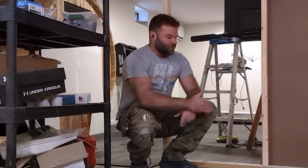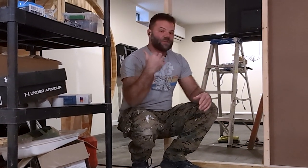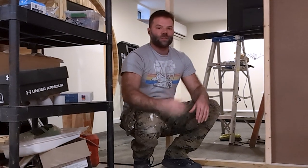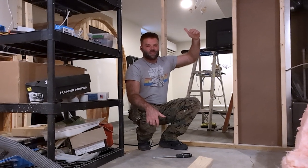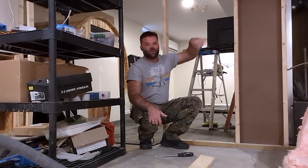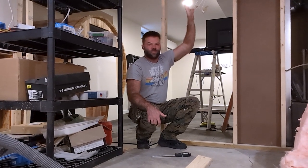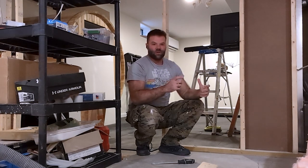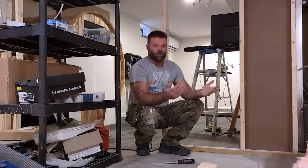My thinking for the column is to design it as if it's a square — the square will fit everything. Then when we get to the angled front part, on the outside it's for decoration, but on the inside it's going to create a negative space where I can pass through all the wires. The projector will be on top as close to the ceiling as possible, the receiver below that, then the power converter. Having that angled chin on the front is going to let me pass everything through with ease, and building it slightly larger will let me upgrade down the line.